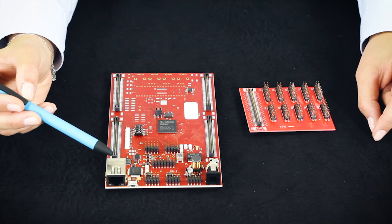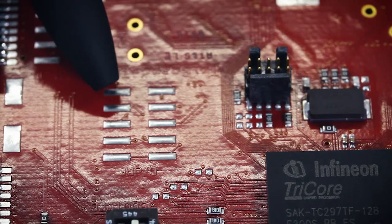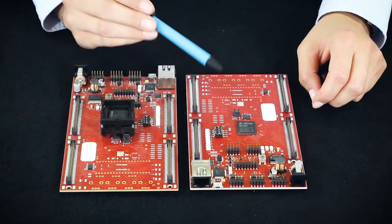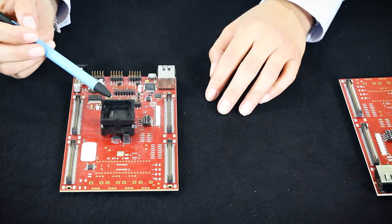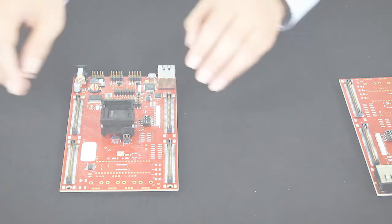Additionally, we have an Ethernet connector with a PHY interface to the micro. Here, we have an HSSL connector for the interconnection of two Aurix microcontrollers. There is a soldered and a socket version of the kit. The advantage of the socket version is that you can easily interchange the device with another one with the same package.